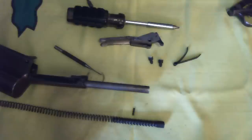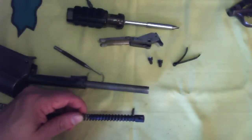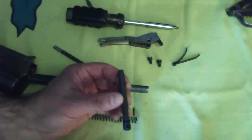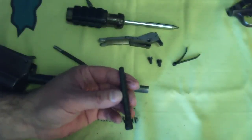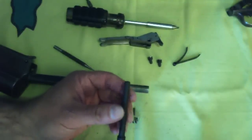If you have an older weapon which has not been disassembled to this level for some time, there may be considerable fouling in this area. Furthermore, the rear bolt spring guide itself is made of wood and may be quite fragile, so take care while removing it. This is a simple piece, so if you know someone with a lathe, you might want to have a replacement made out of brass, bronze, aluminum, or some other appropriate metal. On the other hand, this one is over 100 years old and is still intact despite having seen heavy use.